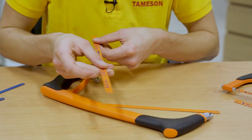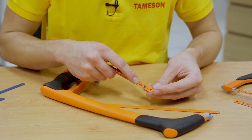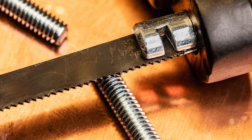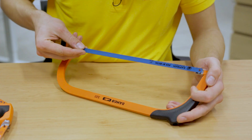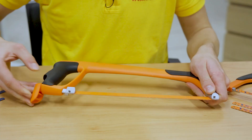Now to attach your new blade, first see if the blade has an arrow on it indicating the direction of cutting. If there's no arrow present on the blade, you have to take a look at the blade's teeth and which way they are pointing — that's the way you want to cut. Therefore, make sure that the arrow and the teeth point away from the handle. Take the new blade, put it onto the hooks at the end, then tighten the blade with your specific mechanism.